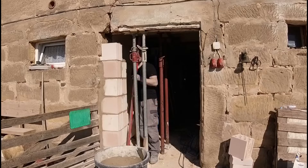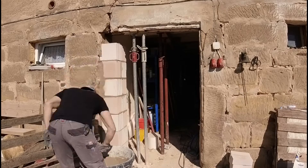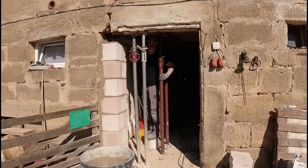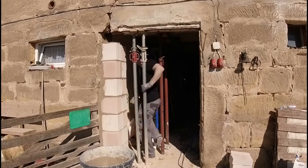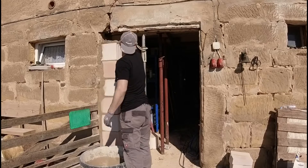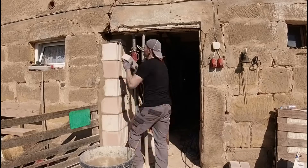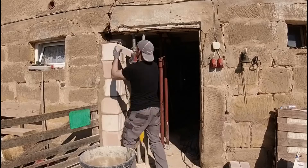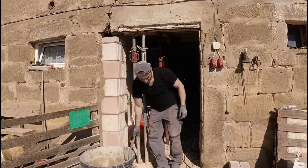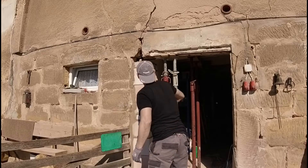You can actually see it very clearly — that up here at the lintel, this is outdoors, and you can also see where the lintel ends: there was a really large crack there, which is where everything had given way. And yes, it was absolutely right to say: remove the old material and create a new bearing, then connect everything properly.